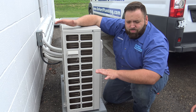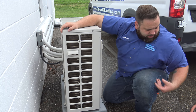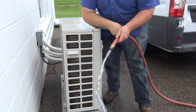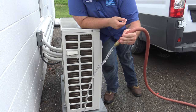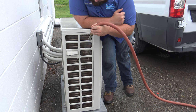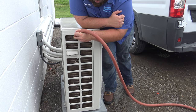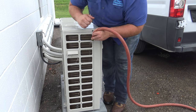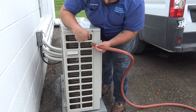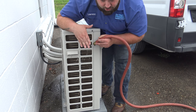This is just to show you an easy way to rinse it off to help it run smooth during the summer heat. Just grab your garden hose, point it downward, and work from top to bottom — just run it back and forth along your coils. The reason we're pointing it down is we want to shed the debris downward. If you point straight in, you'll push debris into the fins. The goal is to clear these fins so there's good airflow and minimal obstructions.